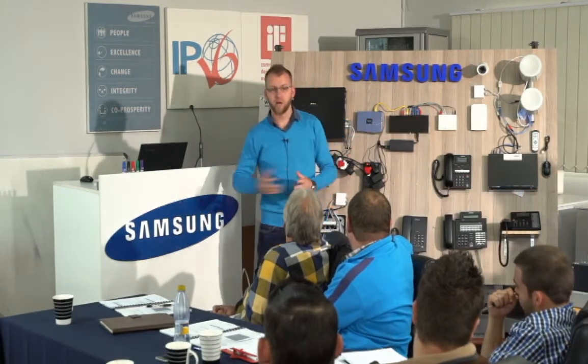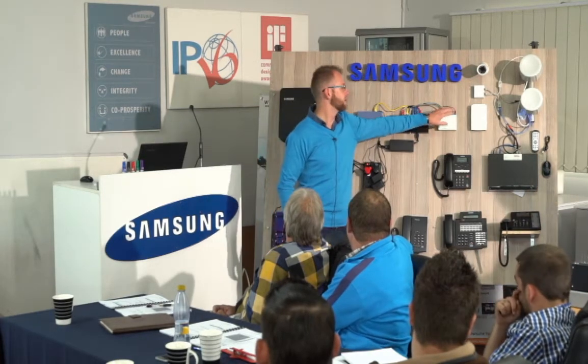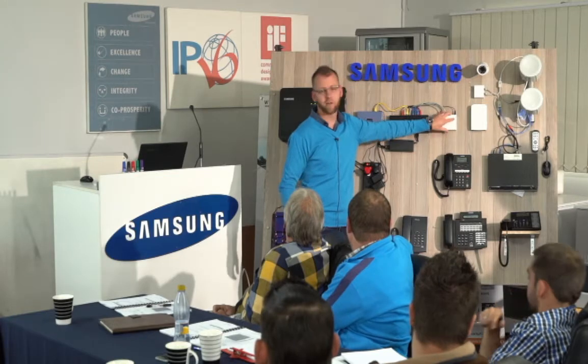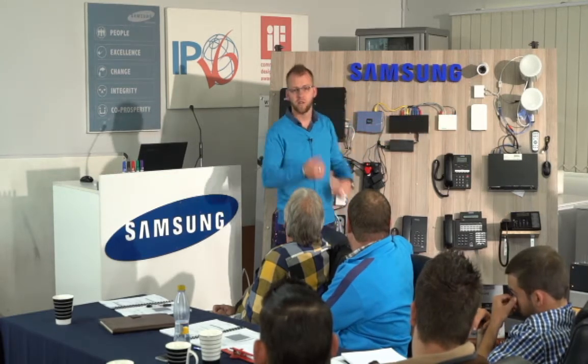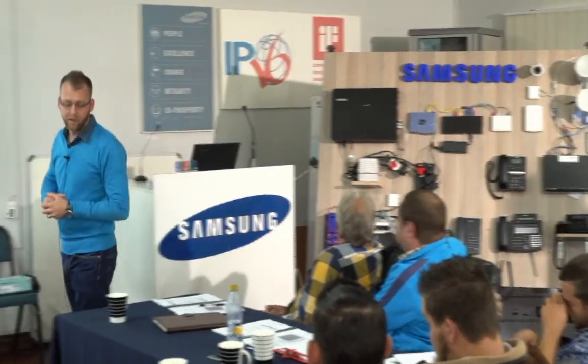If there are no IP phones on site, we can remove the switch and connect whatever LAN devices directly into the Billion. So the AudioCodes also will go into the Billion. Depending on the Billion model, they can come with two FXS ports at the back as well. So the Billion can eliminate the AudioCodes for you as well. So instead of having five devices on site, you now have one device doing multiple things. One point of failure instead of 5 points of failure.